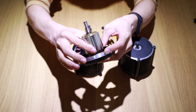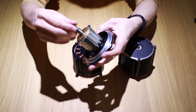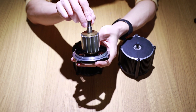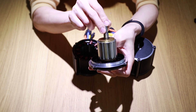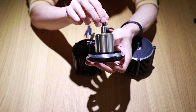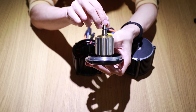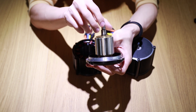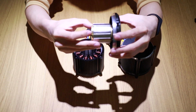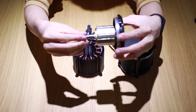Moving on to the rotor part. At each end of the magnet, two dynamic balancing weights are used instead of the balancing putty in the previous version. The magnets of the rotor are N45SH grade, which means these magnets can work at high temperatures of more than 150 degrees Celsius. The magnets are surface mounted, as this gives more torque and has a higher power to weight ratio.